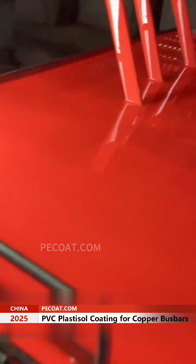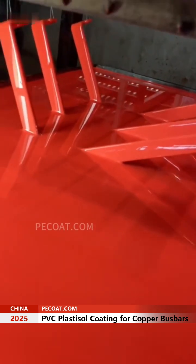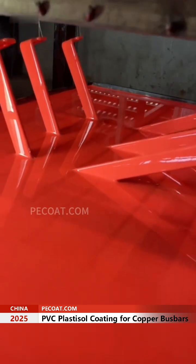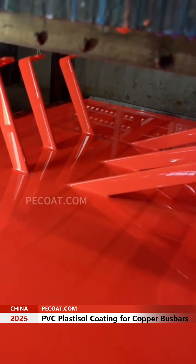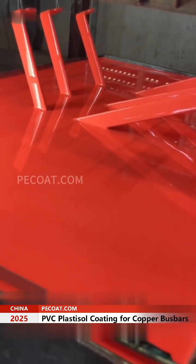Lift it up a little slower — it won't have hanging flow if it's slower. Because this product cannot be flipped while hanging, try to be slower. When the glue has a little temperature you can speed up a little. Here I'm going very slow, about one millimeter per second.